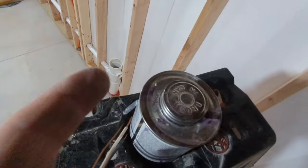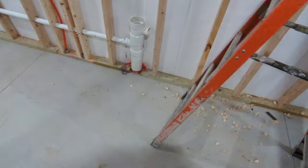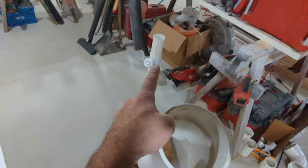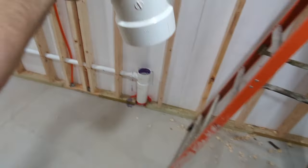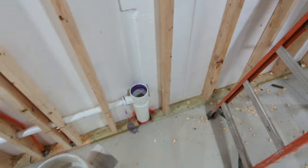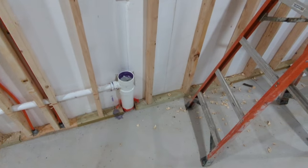So I guess I'm going to start down here and plot out and drill through the wall. And I think I will be right there. Oh, I'm sorry, the clean out. We have to add the clean out, which is that Y, which is here somewhere. Oh, right there. We'll put him in there, and then we'll put this, and then I can plot over and up. See, you want to be careful about the order here, or you have yourself in a bad way.